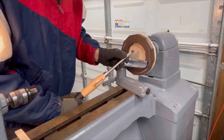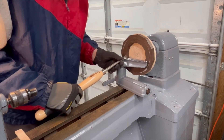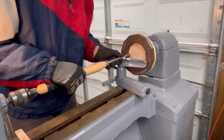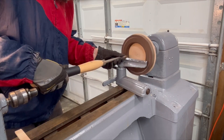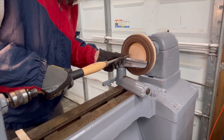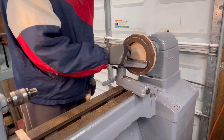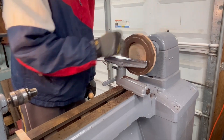I'm going to start off using my square carbide, but before I come out to that circle I'm just going to round this all the way in, because that will finish the bottom from the bottom side. I can actually put a little bit of finish in here. That'll be the bottom where it's already turned — so when I cut this off it'll be done on the bottom, other than the very bottom.